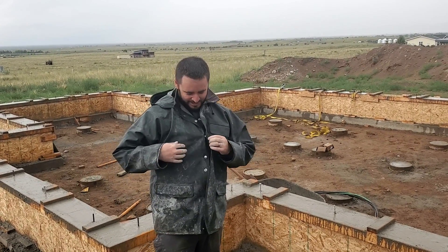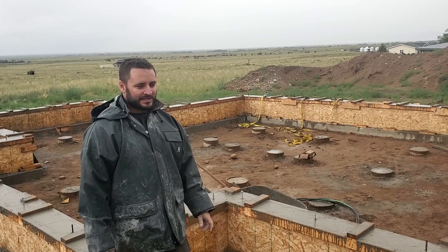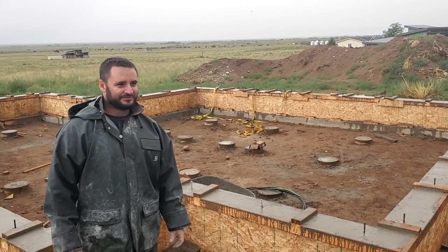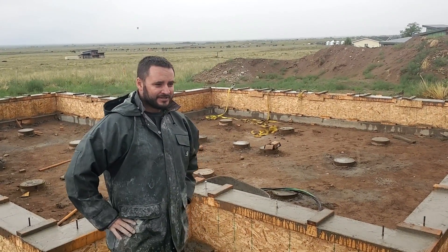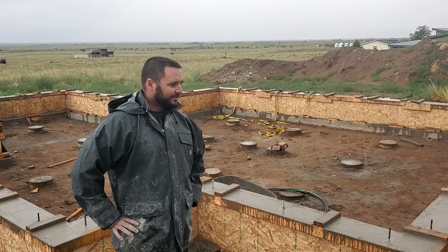Well, what a mess — I'm wet. The concrete went pretty well. Just on that one back wall, the top split apart because the screws were just a little bit too short. But we had those ratchet straps and I was able to pull them back together and save the foundation. Besides that little part, everything went really well. It rained like crazy but that was just a little bit of water on top and we got that off. Put the anchor bolts in, and everything is now curing up. The rain went away, so we should be good. Next step is to put the girders in and the subfloor — that whole floor support system — and that'll be for the next video.